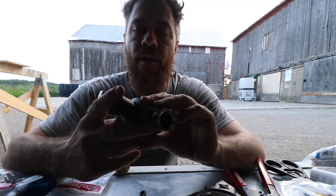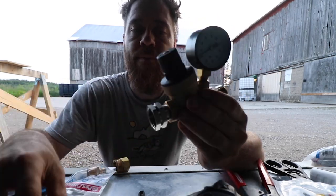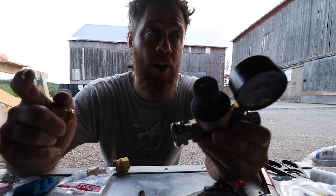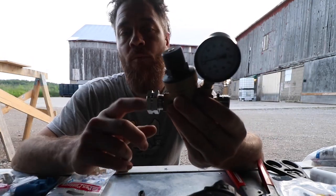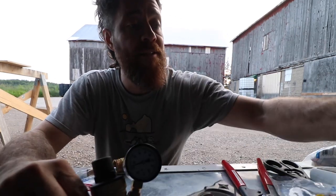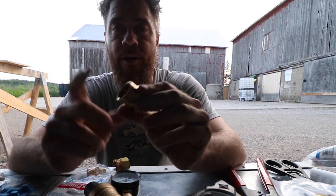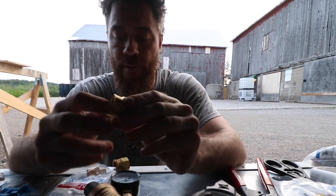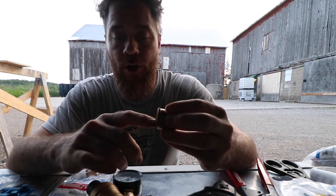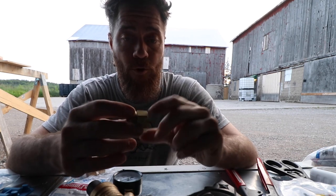So this one here has a gauge on it. The reviews were really good on this one. I'll go ahead and drop a link in the description on which one we actually bought. But this one is typically used for RVs for the incoming pressure, like let's say an RV hooked up to a garden hose on a hose bib for fresh water. So it came with hose ends, just threaded hose ends. So we ended up having to get a male garden hose thread to 3/4 inch female national pipe thread, or FIP, for the incoming side. For the outgoing side, we had to get the male garden hose end to female 3/4 inch national pipe thread, or 3/4 inch FIP.